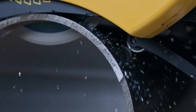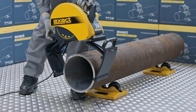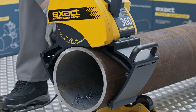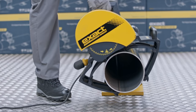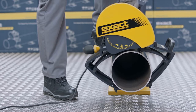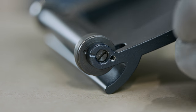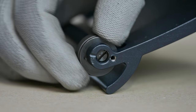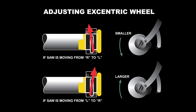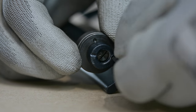Precision of the cut is affected by many factors, the main being the gripping unit and motor unit alignment. First, we will show you how to check if the gripping unit is properly aligned. Attach the saw on the pipe, tighten the gripping unit and lock with the gripping unit locking collar. Then make a mark on the pipe at the laser line. Rotate the saw around the pipe a couple of times with the motor unit off and in the up position, blade not touching the pipe. Then see if the laser line and the original mark line up. If adjustment is needed, use the eccentric wheel — release the locking screw and turn the central part of the wheel clockwise or anti-clockwise to obtain the desired position. If the saw is moving from right to left, turn the central part so that the wheel becomes smaller. If the saw is moving from left to right, turn the central part so that the wheel becomes larger. After adjustment, lock the first eccentric wheel and repeat the gripping unit alignment.